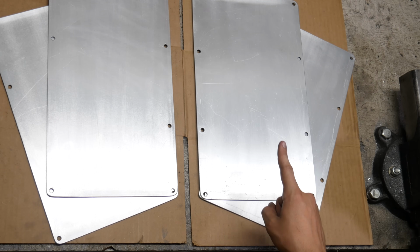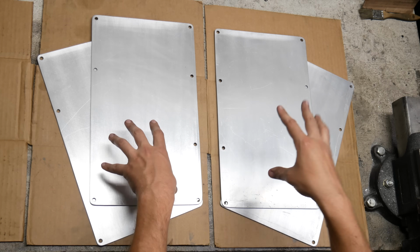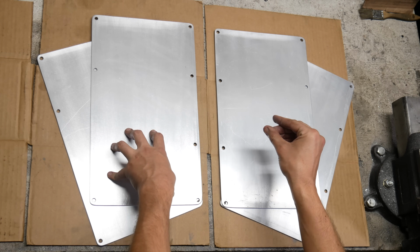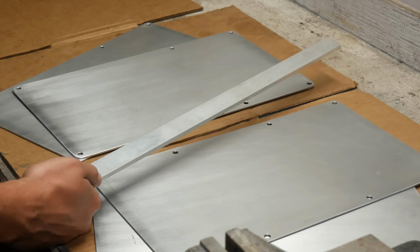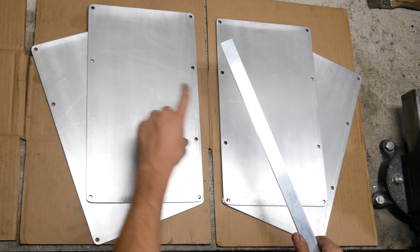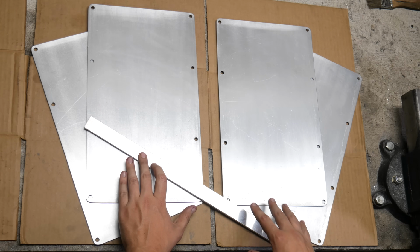There's one last thing we need to do, and we can start trying to assemble one of these. The housings won't be mounted flush against the back of the monitors. They need some spacers so that the bolt heads have room. For that, we'll cut up this 1 inch wide, 1/4 inch thick strap aluminum. We'll be making 4 of these spacers in total, each with 2 bolt holes for the VESA mount. Let's get those taken care of.